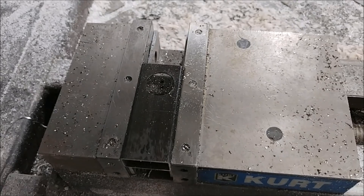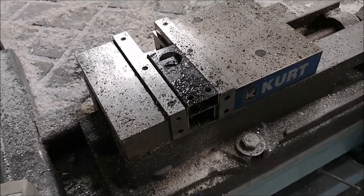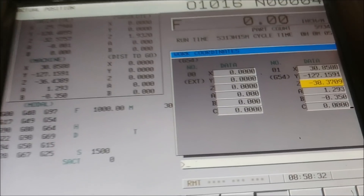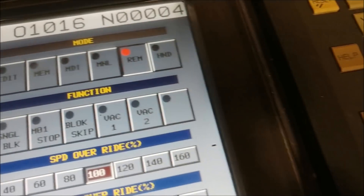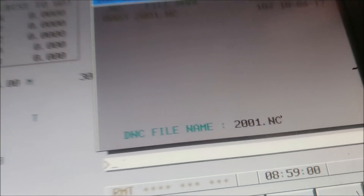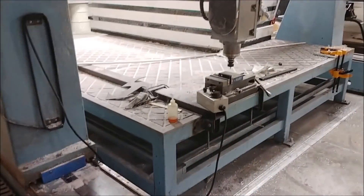There's that one with the hole cut out, and the next thing is to drill the holes, then flip it over and do the other side. I've actually taken it all the way through with the mill. Generally I have to set the work offset - basically set where the end of the end mill is in terms of height - and then zero the machine again by running a little toolpath that sets it to zero. Then I can run my actual G-code that I've exported. In remote mode I choose Program and can see my programs on the SD card - there's the 2000 and 2001. I choose number three, set it, the file name changes to 2001 - that's the one for cutting the slot in the side - and then I hit start.